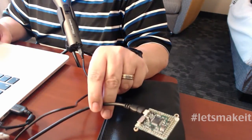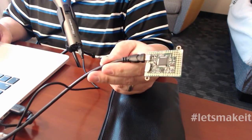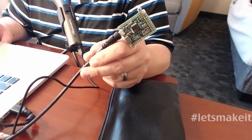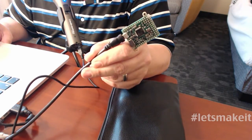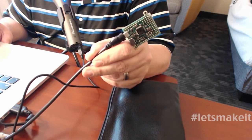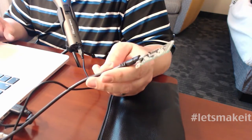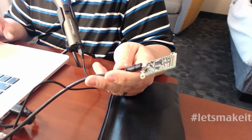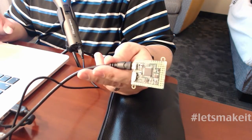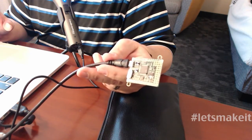So this is the MicroPython board — micropython.org if you want to look it up on the website. It's very tiny. It looks like there are 12 I/O ports on the back. Some of them are GPIOs — general purpose — and some have controls for PWM. There's also an example on the website about using a servo: a very simple couple of lines and your servo is working.